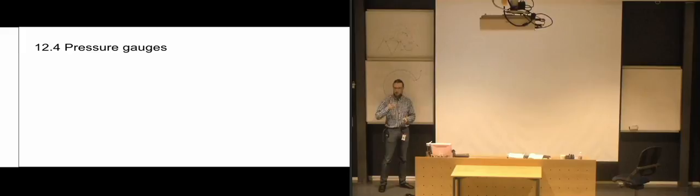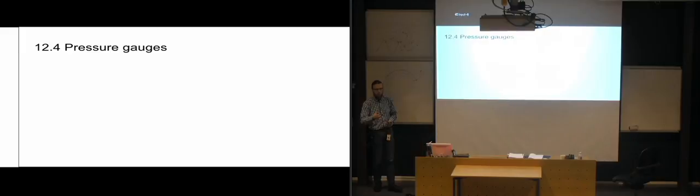So in the case of using a regular gauge like that subsea, where I talked about filling it all the way up with glycol, avoiding having those air bubbles inside it, or for example, cleaning it completely out and letting it fill up with seawater instead. So basically letting the seawater do the job of the glycol in there with the dampening effect, to save the pressure gauge from being broken by the external pressure of the water. But letting it fill up with seawater means that you have a lot of metallic parts in there.